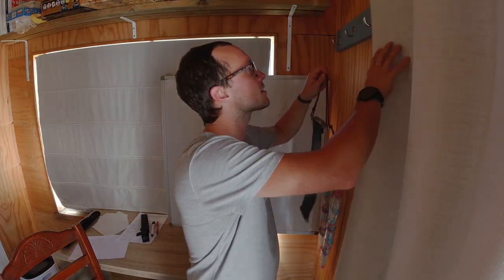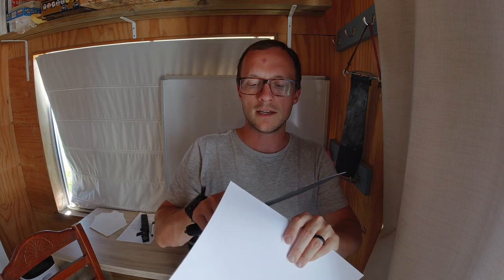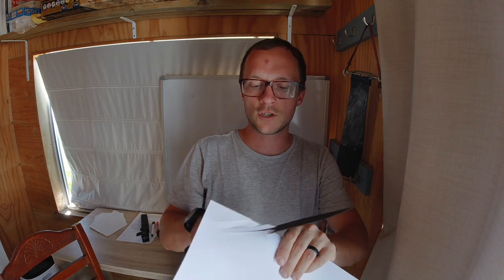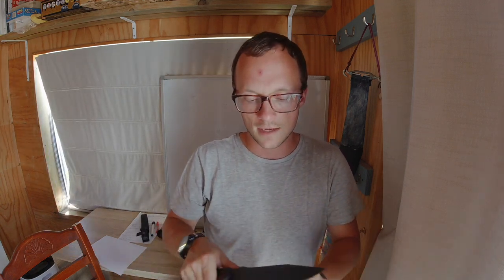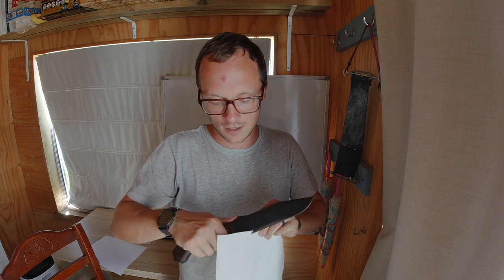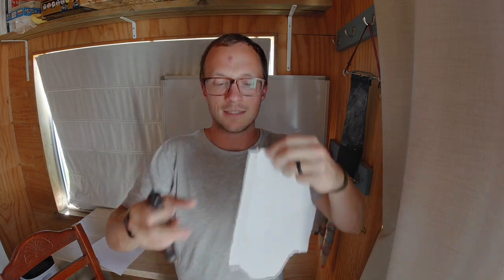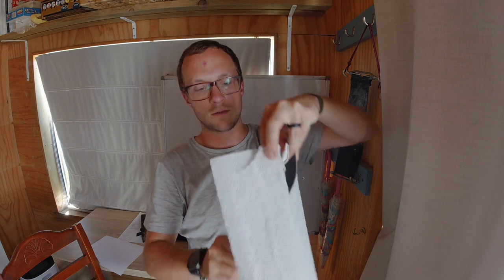Once you've done everything, you just want to hook up your swivel and hook it on some surface. I'm trying to get a surface where you can see it well. So this edge, even though it didn't test ultra well, it's quite keen — it's push cutting without a problem at all. I'm really hoping that the stropping we're about to do will actually produce an edge that tests under 100 BESS, because if it does, I can use it for my next chopping test where I really need an edge that is under 100 BESS. It quite easily slices the paper towel, and if I grab two sides it would just laser through it pretty well.